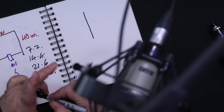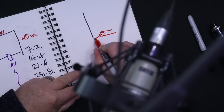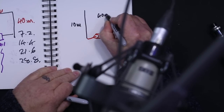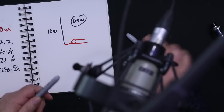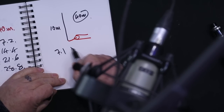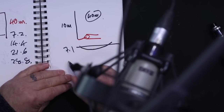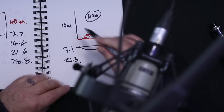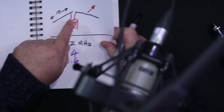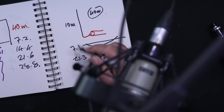I was on holiday in Cornwall, about 10 years ago, mucking around with a vertical. The coax came along, the center went straight up — it was about 10 meters long, aiming at the 40 meter band. I noticed it was behaving as Nigel described: I was getting a tune at about 7.1 MHz, and also getting resonance at 21.3 MHz. So a dipole and vertical give every other harmonic, and a loop gives every harmonic.